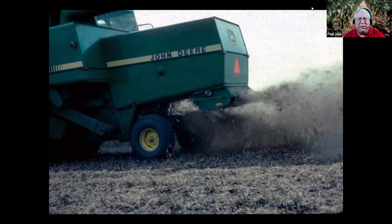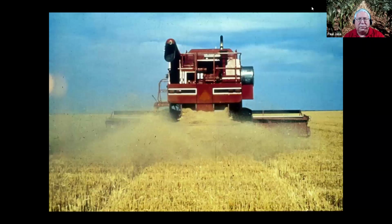There's a windrow of pods there, then there's a strip without pods, then there'll be another windrow of pods. And when it comes to uniformity next spring, that's going to be two different soil temperatures, two different soil moistures. So again, in platform head, you need to spread the chaff as well. We do spread our chaff. We don't run a chopper, but we do spread our residue.